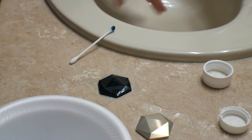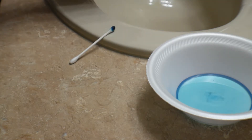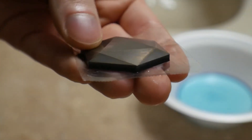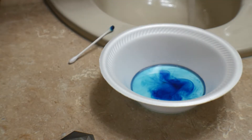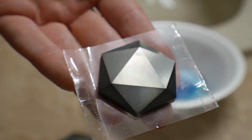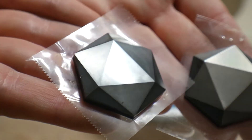Allowed to work one minute — this is gonna look nuts. I kind of messed up — I should have just dunked the whole thing, because now I have these scars where there was more brass black than the rest. That kind of sucks — I kind of ruined the finish. But I am going to put the other side in and try it again for a full minute. That looks a lot better — there's still a little bit of unevenness but not much. I'm honestly going to put this side back in — it vaguely helped and did make some slight changes.